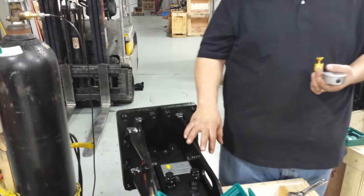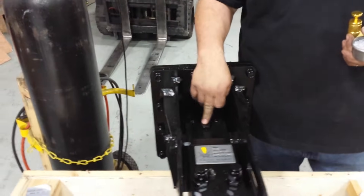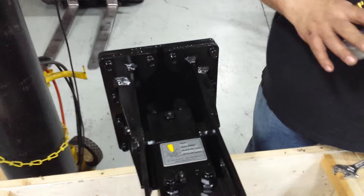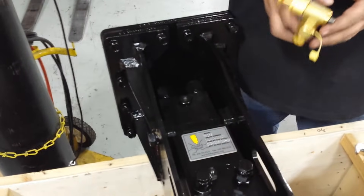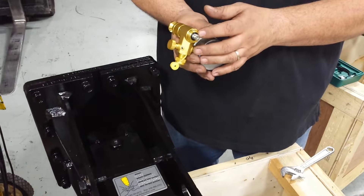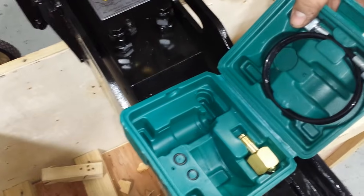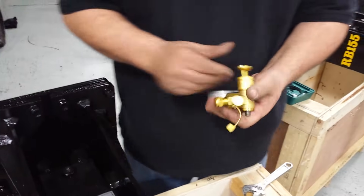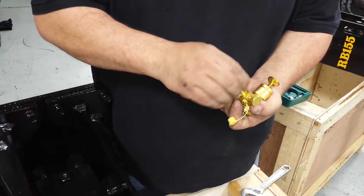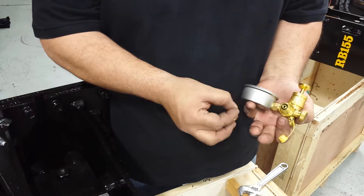Here's the procedure for checking the charge. We remove the protecting cap of the gas cap from the top of the breaker. The bottom of the charge tool has a plunger with a little O-ring. If the O-ring gets lost, you do have one replacement O-ring in the box. There's also another O-ring for sealing another part, which we'll explain in a minute.